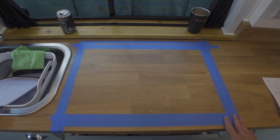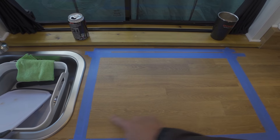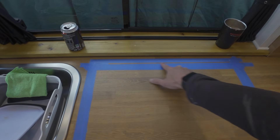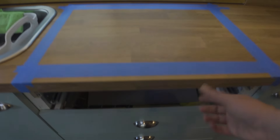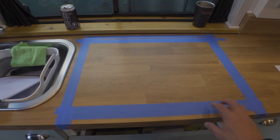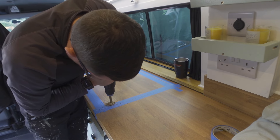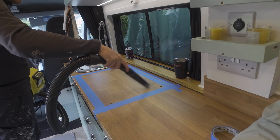I've masked out what's needed with the lip. We've got 347 mm top to bottom and then 528 mm across — that's just the internal cutout for the induction hob. It will then sit up to about this line here and up to this line at the back, which should run pretty parallel with the gap at the rear. I've checked underneath — this is 38 to 40 mm and it says five, so we've got enough room underneath. I've got a couple of wooden braces there but we'll sort that out. I'm going to go ahead and get this cut out.